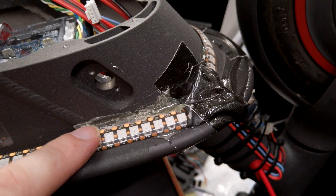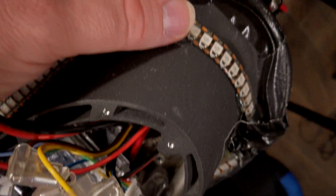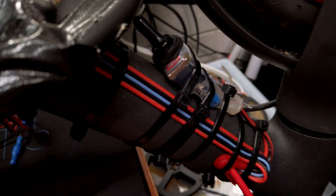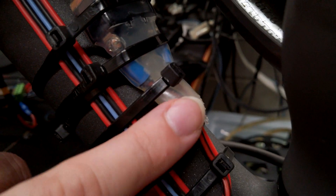You saw me hot gluing the LED strip in place in several places. Over here I just really want to make sure it's not going to fall off, and on this side I did the same, especially with the front strip. For the button, I took a really large heat shrink and basically encased it in the heat shrink and then screwed the protective cap on top — that should make it reasonably watertight. On the back, I injected the heat shrink with hot glue. It's a good thing I'm using silicone cables — I don't know if plastic cables can withstand that kind of heat, but these silicone ones should be fine. That should be pretty watertight — it's basically plugged up with hot glue. And then I tie-wrapped it all down.